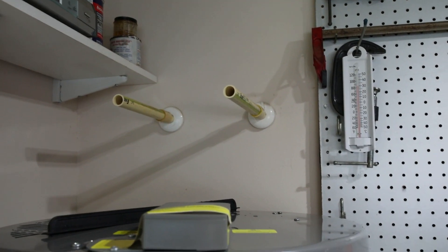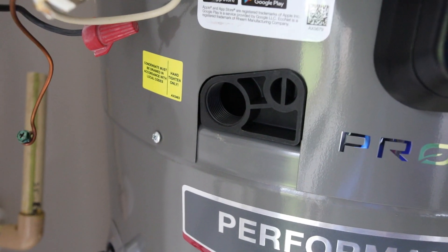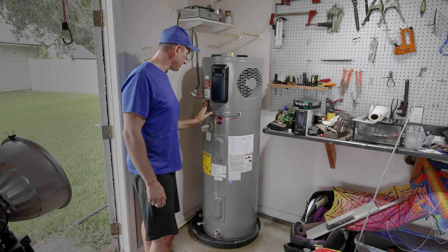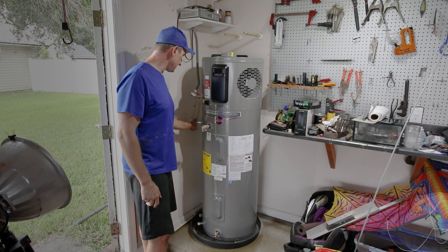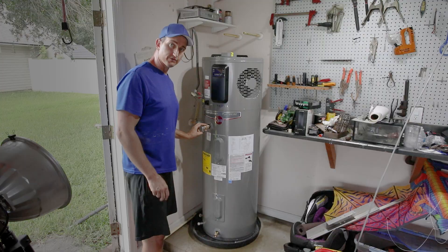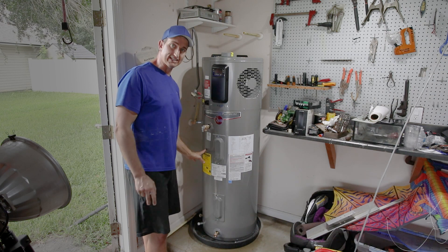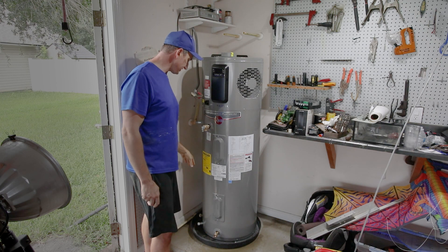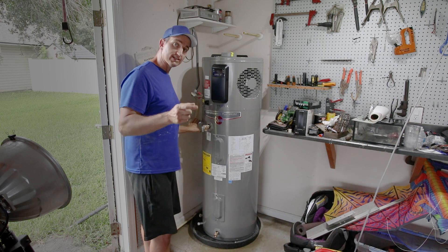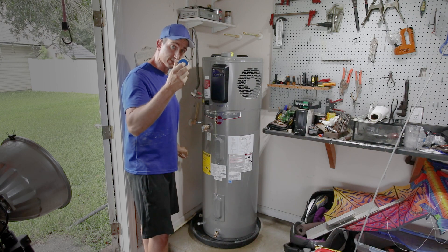The trick is to get the cold line down to the cold water inlet and the hot line to the hot water outlet. I need to thread a fitting in here and pipe out the condensation line. For the condensation fitting, I'm going to plumb from here to the old purge valve line that goes outside the house. For now I'll just run the purge valve pipe down into the drain pan and may plumb that differently down the road. I'll start by connecting fittings that go from metal to CPVC, wrapping the threads with Teflon tape — about four to six wraps, clockwise.